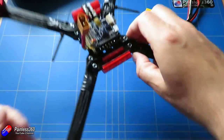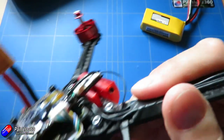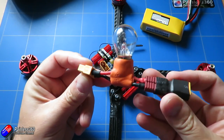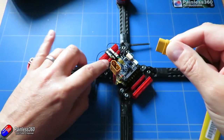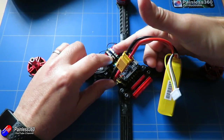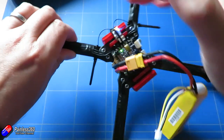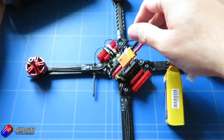We're going to have to plug the battery in. To get power from the bottom power distribution board and ESCs into the flight controller, I've had to install that cable. If you wanted to use something like a smoke stopper — just a bulb in series that limits the current — that's an option, but as we've already tested this we should be fine. We press and hold the bind button, plug in the battery, the ESCs will beep, we've got flashing lights on the receiver — that's promising. We grab the radio, exit out of the bind, then unplug the battery. That is the receiver bound.